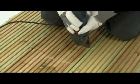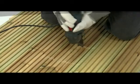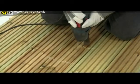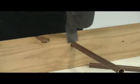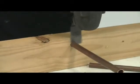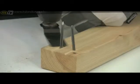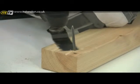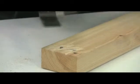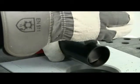The straight blade allows you to make deep plunge cuts in wood, as for instance when making cutouts in decking or floorboards. You can cut non-ferrous metals such as pipes. And you can even cut non-hardened screws and nails. Plastics are no problem for this blade either.